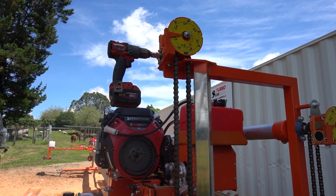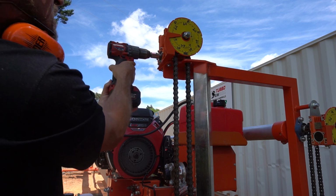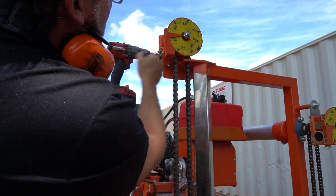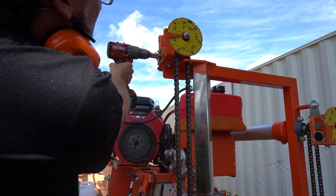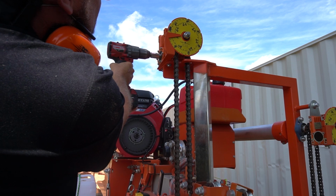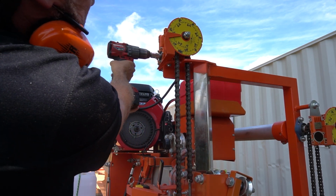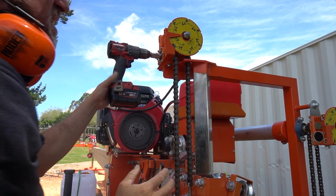We'll bring it up to 6 inches, so we'll just show you how to bring it back up from 12 inches. So here we go. We're going to follow that scale all the way back. So now we're 275, 10-inch, 8-inch, 7-inch, 6-inch. So I'll go up higher and then I'll lower it down onto the 6-inch. Go down. Okay, now that's going to be a nice, accurate 6-inch.